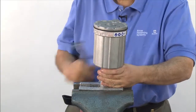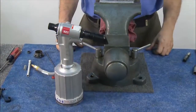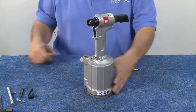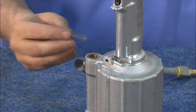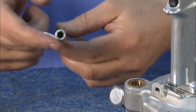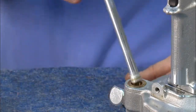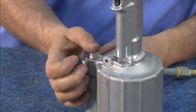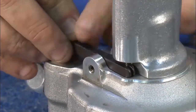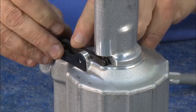Once the cylinder is completely installed, remove the tool from the vise. You're ready for the final step in the reassembly of the 2025: the throttle valve and throttle valve guard. First, drop the spring in the throttle valve hole. Grease the new O-rings of the distributor valve and insert. Manipulate until they go through. Next, insert the cross arm, hooking it through the cable. Insert the guard, then the cross screw, and tighten.